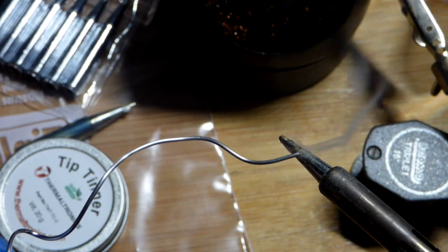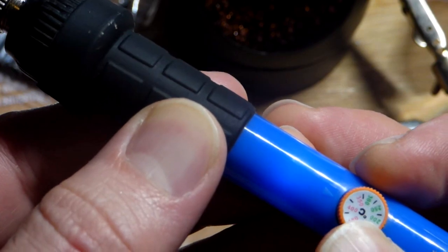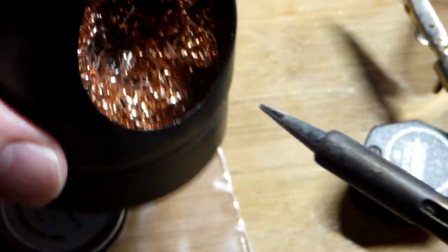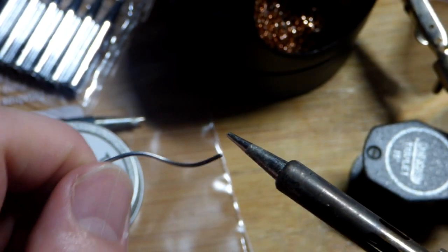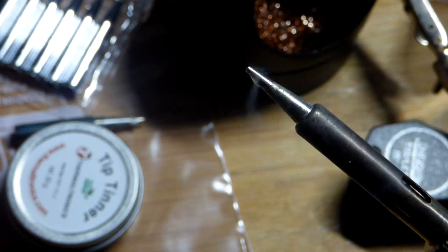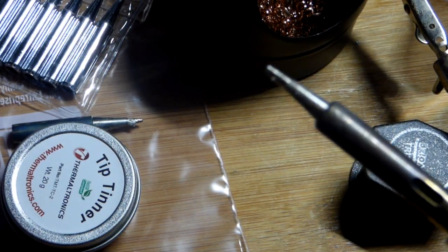I'm at 450 right now and I already notice the solder is melting and flowing onto the tip. At some point there's going to be too much and it'll start dripping off, so I'm going to lower it to 400 once I notice that, maybe a little below 400. Once I notice it started flowing, I'm going to try to clean off that extra I left on there to make sure there's a thick layer to keep it from oxidizing. We can kind of twist it — I think we still have a little on there.